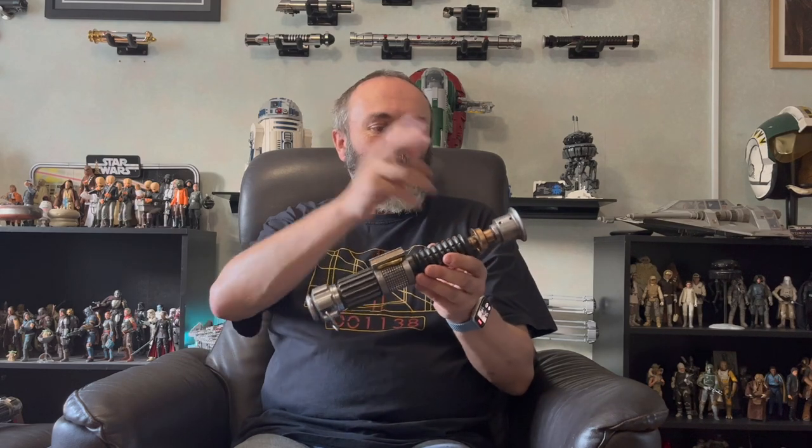When you're spraying it on, try and get an even coat on. Don't absolutely smother it in one coat. Put several light coats on. This had three coats. I normally allow about 20 minutes or so in between coats. And of course, when you're using a spray paint, it's really important that you do it in a well-ventilated area, preferably a warm, well-ventilated area. Temperature can affect the surface finish that you get, but definitely a well-ventilated area, and please use some sort of respirator or mask to protect yourself from the overspray and fumes from the spray paint.